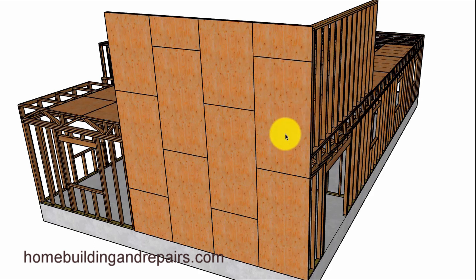So you're probably going to have to cut this one a little smaller. If you had 24-inch joists you might be able to use a full 8-foot sheet, and then a piece 2 feet or a little bit larger. This is staggered 4 feet off center for the next piece. These pieces right here are the ones that in my opinion really hold the floors together because they're connecting the two walls and sandwiching everything in. This one right here is the top plate.